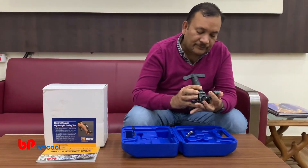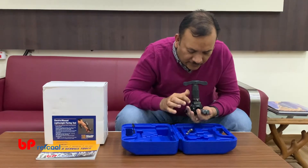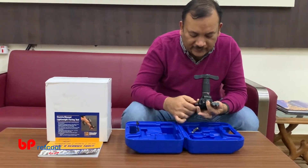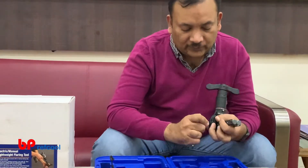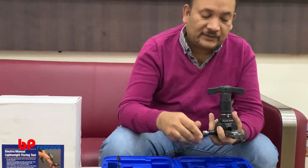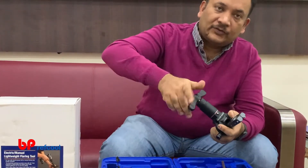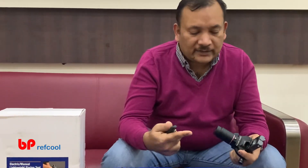I took it to 3.8 again. This arrow should be meeting this white line. So once this is done, just tighten it — not by hand, but with this tool. I did it majorly by hand for ease. So now this is done, just flare it. Once you flare, you have the option of flaring it by hand or by just pulling it out and using any electric drill or a screw-tightening gun, which can help you out with this flaring.